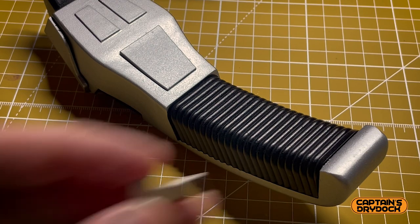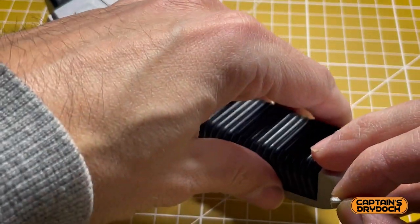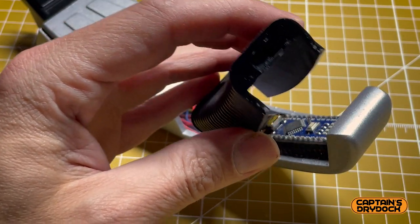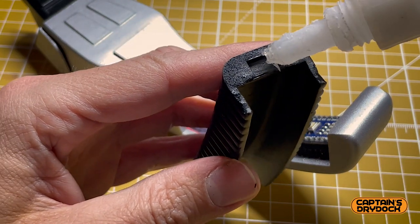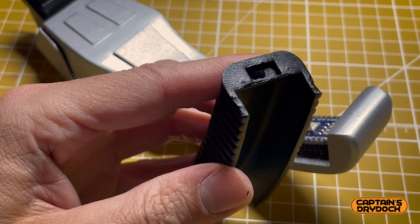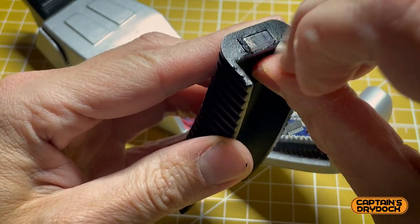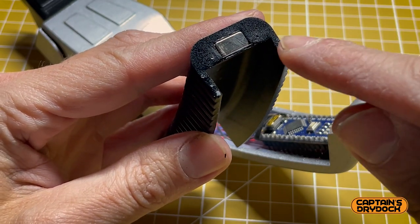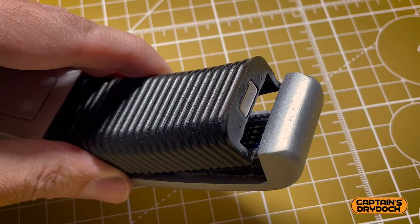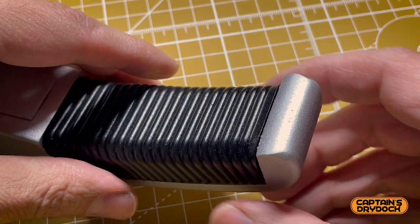The second-to-last thing I need to do is add the magnets. There are two small magnets for the indent in the handle cover — once the handle cover goes down I want it to snap straight into place. I add just a tiny bit of super glue, add the magnet — this is made to measure this precise magnet — let it dry, then put the other magnet into the handle. Now I just let it go for the satisfying clip — look at that, it automatically puts itself in the right position.